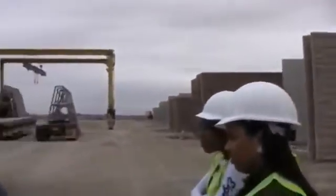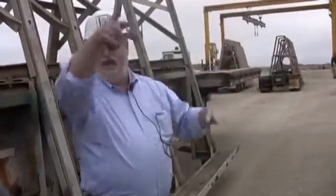To be designed, let's say you're going to put a double T roof on there. A double T roof will weigh 64,000 pounds. So this side of the building, this wall panel, and then this wall panel will have to handle 64,000 total, so it'll be 32 and 32. The engineer has to go through every single one of these things and make sure the reinforcing is done right, making sure all the inserts are in the right spot, making sure all the integral parts are done ahead of time before it comes into the plant. That means that wall panel will have to handle 32,000 pounds. Now it's up to my engineer to say, okay, that panel is no longer 8 inches thick, it's 10 inches thick, or it's 12 inches thick.